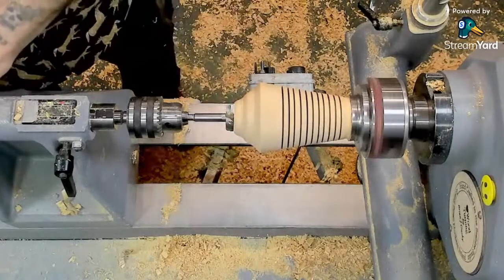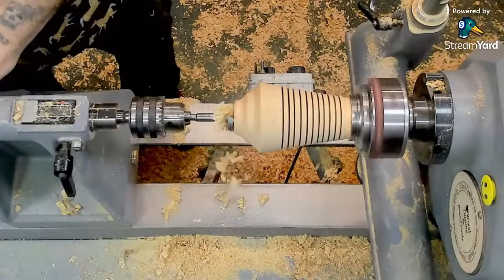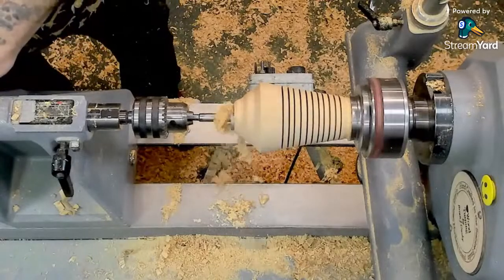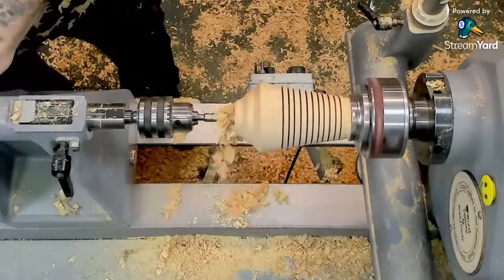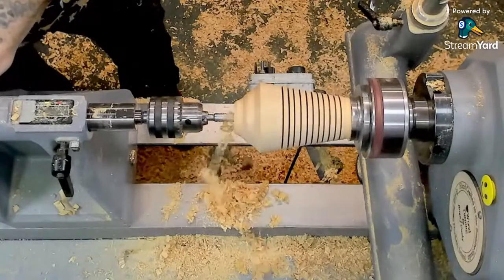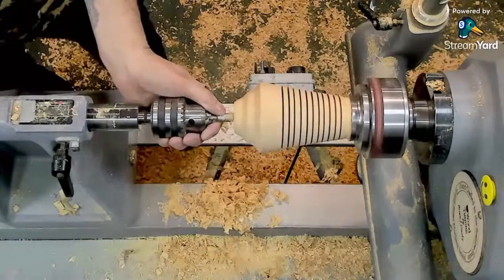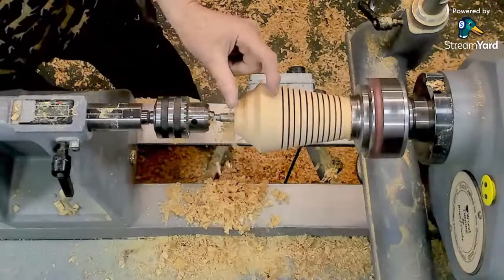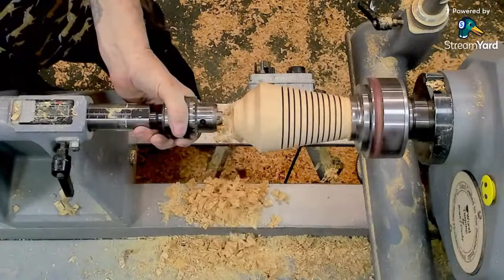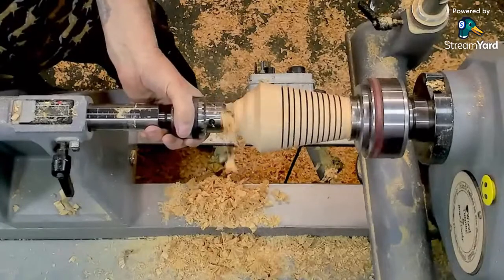Turn the speed down a little bit. And let's see, can we drill a hole through this? Oh, this might not work, mate. Have you got a forstner bit and a bit of extension for that or not? Nope. It's only a short forstner bit. I don't know how far he wants that to go. Right. Okay, because I'm only going so far here. And then I'm going to come out and put the 40mm in, down to here, and then put the 35mm in the rest. I don't need all this. I can take some of this away as well.